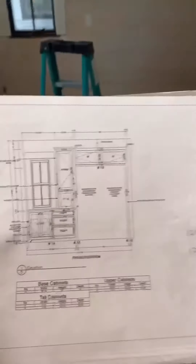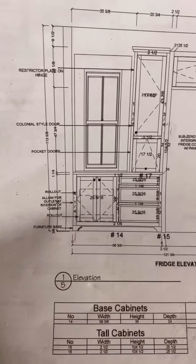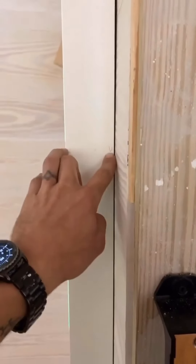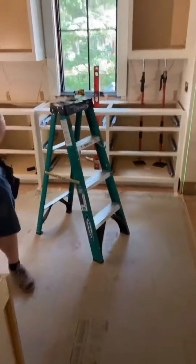So to start, we're gonna go start with our fridge, work our way over, and then set the base run. We set it in here plumb, level, square to the wall — so we got plumb this way and plumb that way. We want this filler to end up at two and a half inches. Mark about halfway between my gaps at two and a half inches, then we'll pick a little scribe block — it's going to fit. That's a quarter inch.